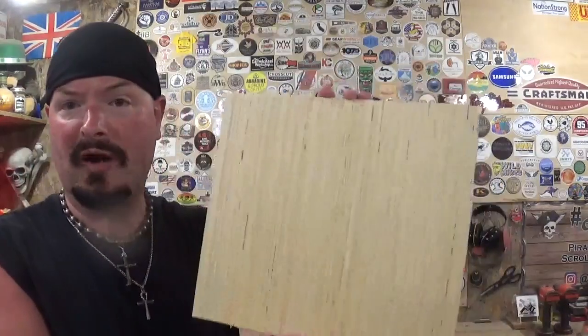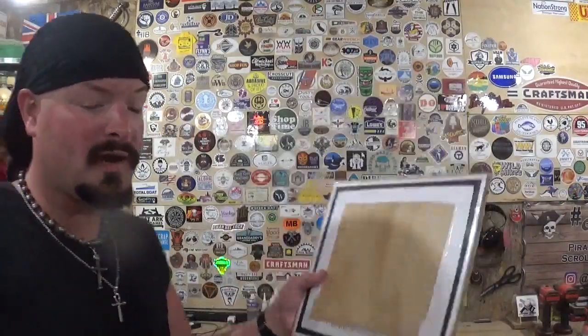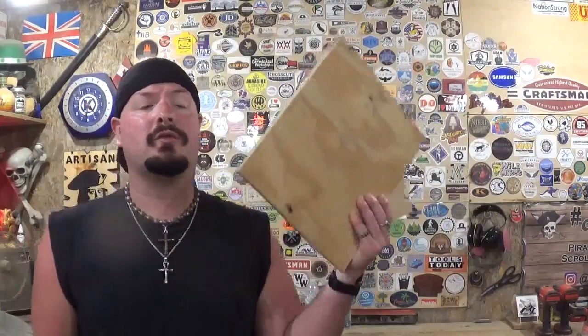The backer board we are going to start with first, and we'll move the camera and spray paint this white, and then the border, which is going to be painted black as well, will be cut out, and this is 1/2 inch plywood, and all this except the 1/4 inch material here came out of the scrap bin, so keep that in mind. I really didn't want to use up any of my quality wood that I use to document videos, and I hope you guys can understand that. But since everything is prepared, let's move over and spray paint this white so it can start drying, and then we will head over to the drill press and drill the required pilot holes so we can come back to the scroll saw and start scrolling.